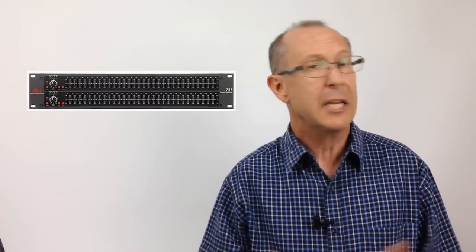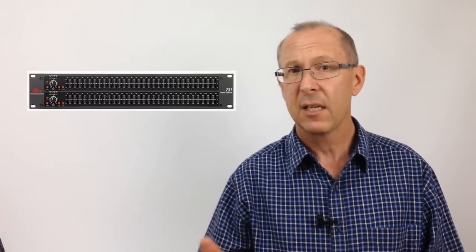Another thing you can do is set up a curtain at the back of the stage. That'll help prevent reflected sound coming back into the microphone again. A graphic equaliser could be purchased — it's quite an economical way to balance the sound in the venue. Each room is going to resonate in different ways at different frequencies, and a graphic equaliser has the function of being able to reduce the volume of each of these troublesome frequencies independently.